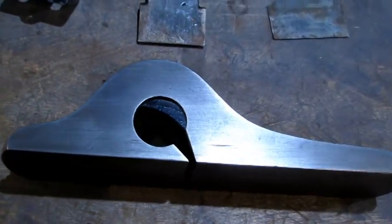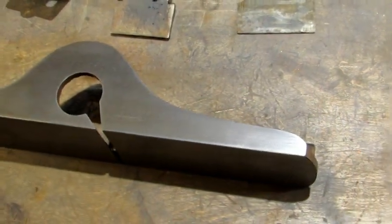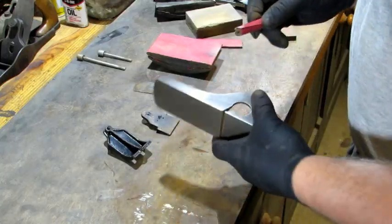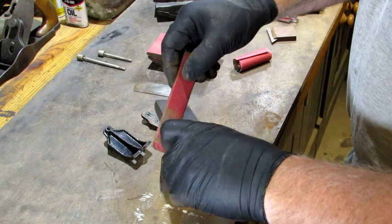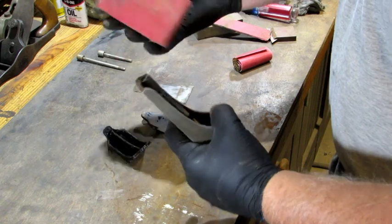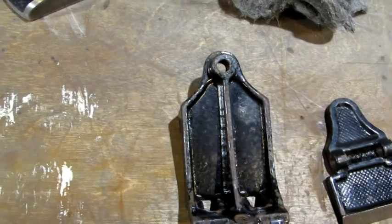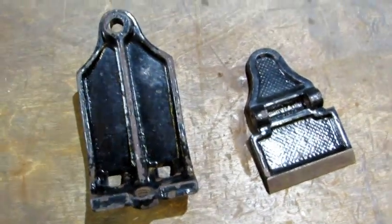With the 3000 done, I've still got some staining and darkness to the metal — it doesn't look shiny new, you can still see the original machining marks and a little bit of staining on the bottom, but it looks a lot better than what it did. Next is a rolled up piece of 150 to get into the throat cutout, 150 on a piece of wood for inside the throat, and 150 on a sanding block to do around the edges. With all the machining surfaces cleaned up on the bottom, I'm going to take some steel wool lightly over all the Japan surfaces to remove the rust on the leading edges.